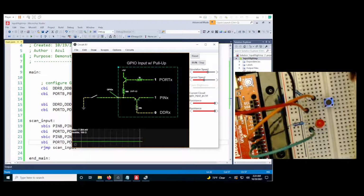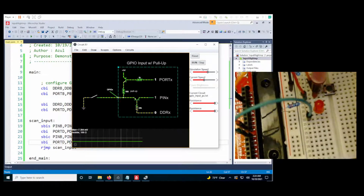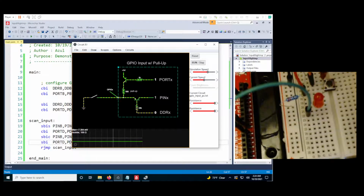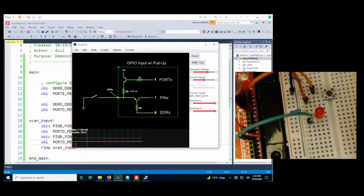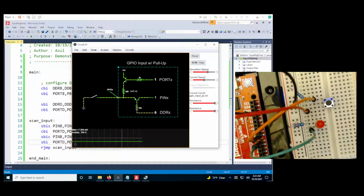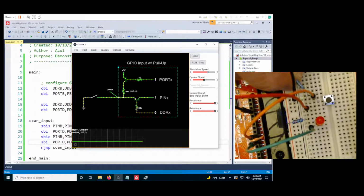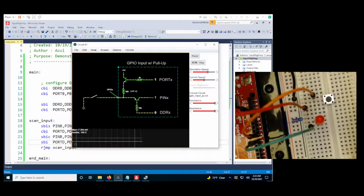into one terminal of our switch, which I have as terminal 17. And then the other terminal is going to the orange wire on terminal 15, which is going to my input pin. We also have a pull-down resistor in terminal 15 to ground. And if we notice in our electrical circuit, we're not going to need that anymore. So the first thing I'm going to do is remove this 1K ohm resistor that was being used as a pull-down. And I'm going to remove the 5 volt source